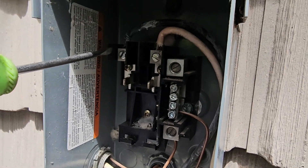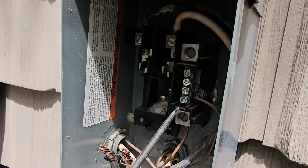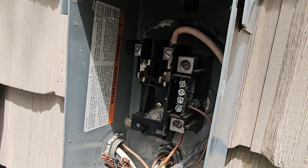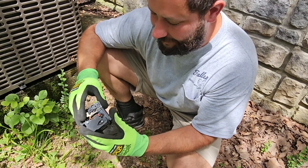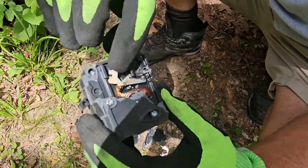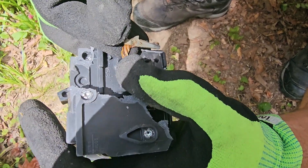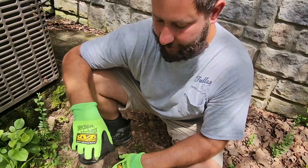Let's check: is this tight? Is this tight? Yeah, it's tight. Is there a ground wire? There is a ground wire — is it tight? Everything looks tight. So I think we just had a bad breaker. Let's take this breaker apart and look inside. This breaker just fell right apart. You can see inside — on this side — the wire is becoming discolored right here. This part is actually pretty hot too. You can see how this heat can damage the breaker easily.